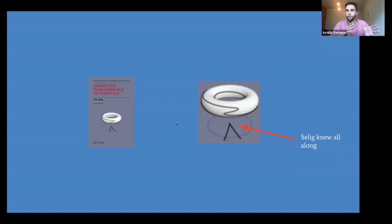That also counts for a cuspidal robot. So you can take the first 3 links and joints and look at those to determine if you have a cuspidal robot, and then the analysis that I just did will apply. If it's a robot that looks exactly like the one that I showed, where each of the axes are orthogonal to one another, but there are no offsets, it's not going to be cuspidal. If you have that same non-offset first joints, but you add a non-spherical wrist like the Kinova Mico, which had 45-degree angle joints, then it will likely become cuspidal.